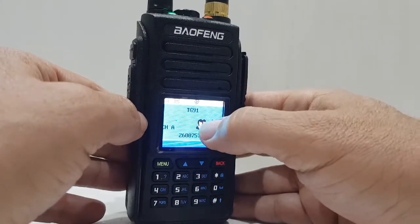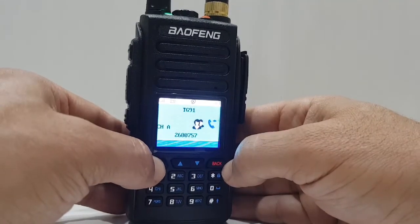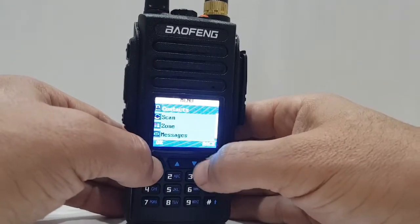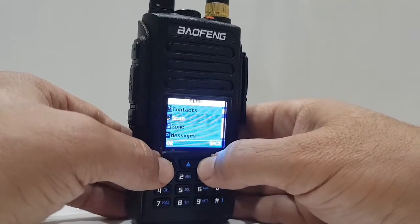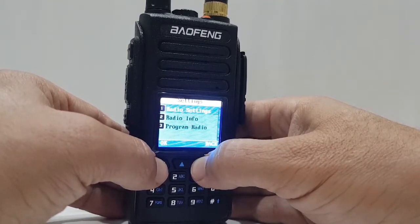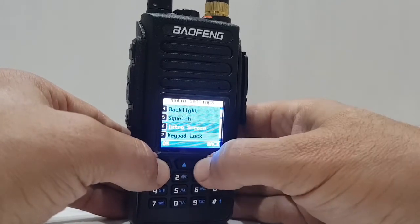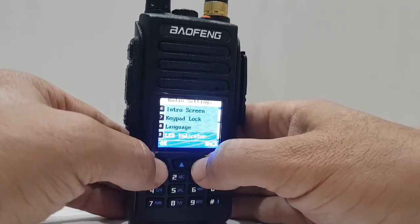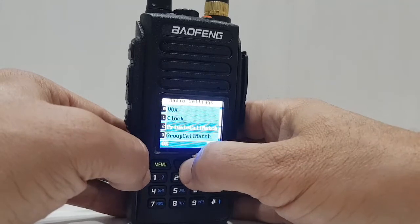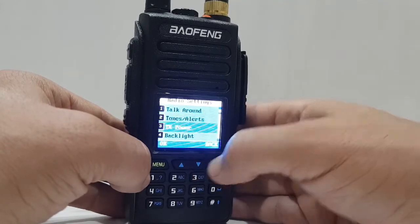When you hear stuff you get this face and a little phone there. When they're talking it's hard to get into the menu — to get out, go up the arrow and go to a different zone, then you can get in the menu. It has got scan — I haven't done that — zones, messages, call logs, settings. Settings has quite a lot of things: tones, the radio makes keys make tones, intro screen you can personalise, keypad lock, LED you can say what the LED is going to do, vox, clock, group call match for basically promiscuous mode, GPS, channel name, SMS format and backlight.